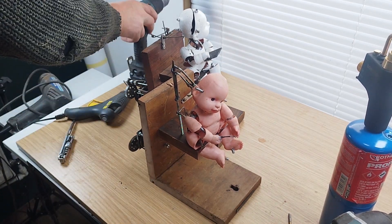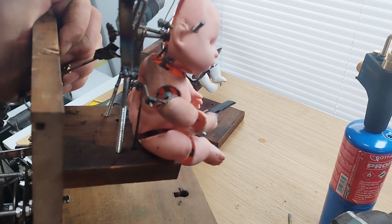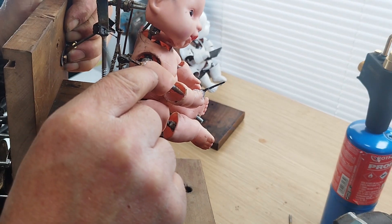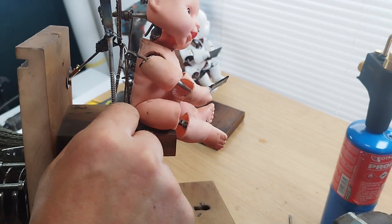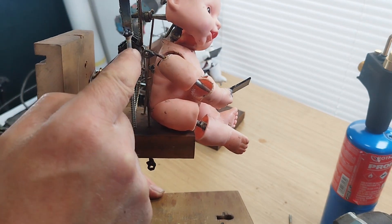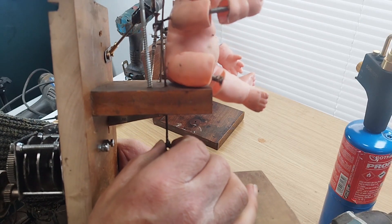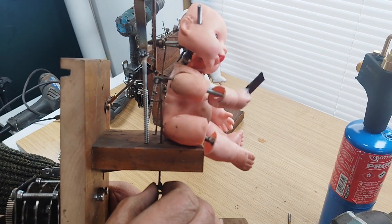What I've done since I last showed you: I've put this rod in through here by heat — welded a nut onto the end of a small piece of rod, the same sort of stuff as this, heated up the rod, pushed it into the glue, and waited for it to set. Then I cut another rod, drilled that, took this whole thing off, drilled from underneath, and put another rod in here with a bend in the end that lines up. I've also greased it; it's got a nut welded to the underneath.